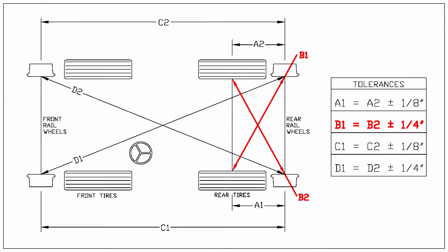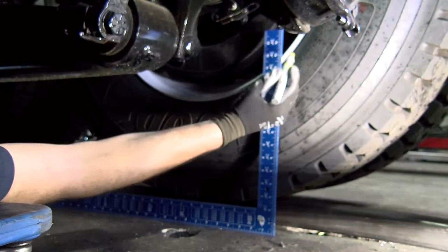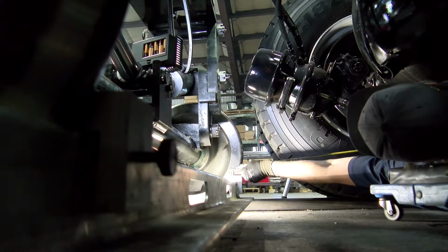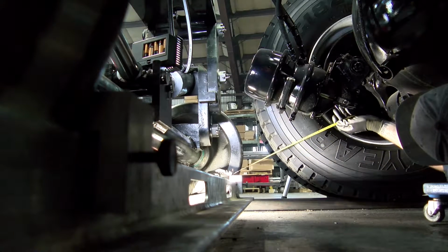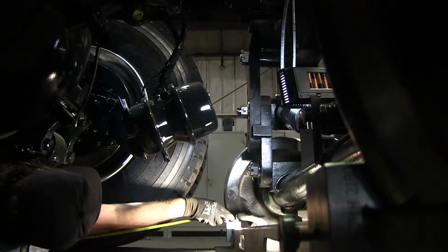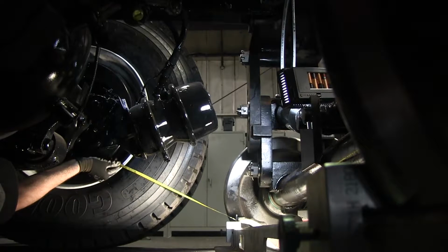It's often difficult to find a symmetric point on both sides of the truck rear axle to take measurements from. One option is to use a framing square to mark a measurement spot on both inner dual wheels. The marks need to be the same height off the rail on both sides of the truck and at the rear edge of the wheel bead. Choose a height that allows direct line of sight with the alignment pins on both sides of the rear rail gear.